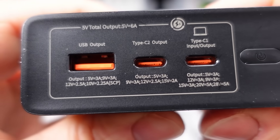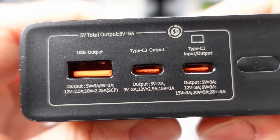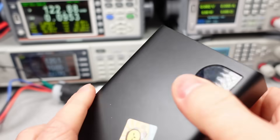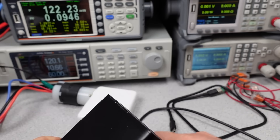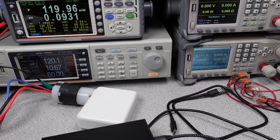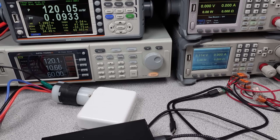In terms of alternative features like power pass-through and UPS — that's uninterruptible power supply functionality — this does reasonable here. It does renegotiate on power output and unplugs in some situations, particularly the high power port, but when using it during charging, the lower power port does stay on. It won't push 20 volts out, but that port will stay on, so it technically works, though it isn't really designed for this job.